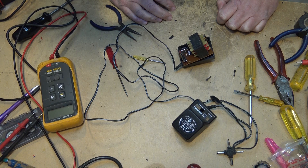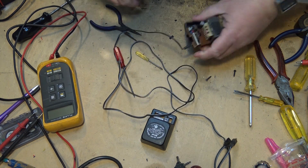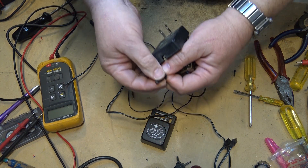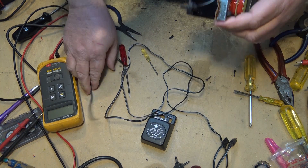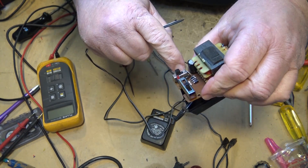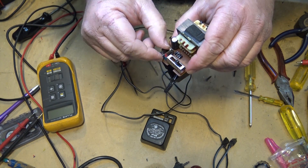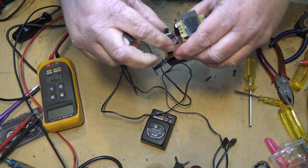So that I can use it on some small portable electronics that use oddball plugs. Let's get the strain relief apart if I can. I probably won't be able to put a strain relief back on this because it's been all molded on here, so I'm just going to cut the wires and splice it — I'll lose my strain relief, but we'll figure something out. This is going to be a pretty straightforward repair. The wire with a stripe here, the wire without down there. This has got a polarity switch on this adapter, which makes it nice because you can have either tip negative or tip positive, and the multi-voltage switch.